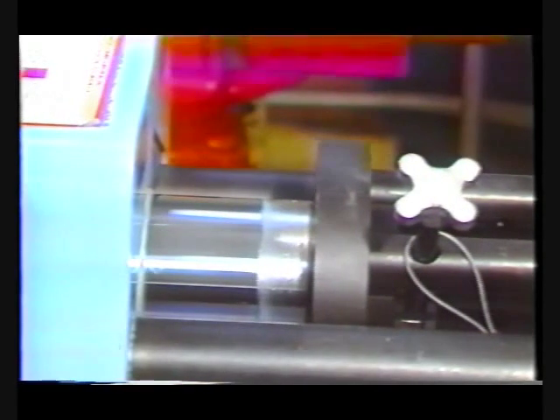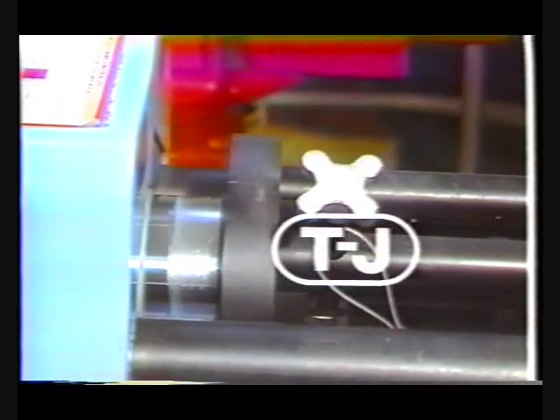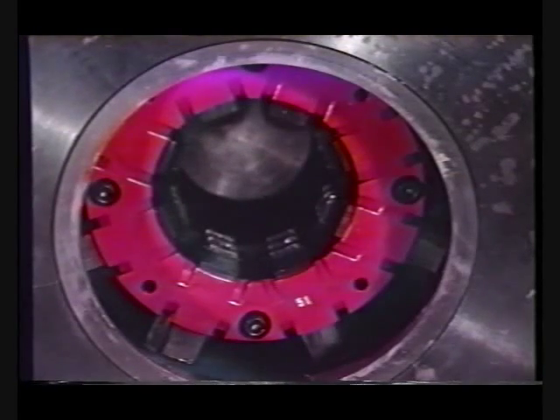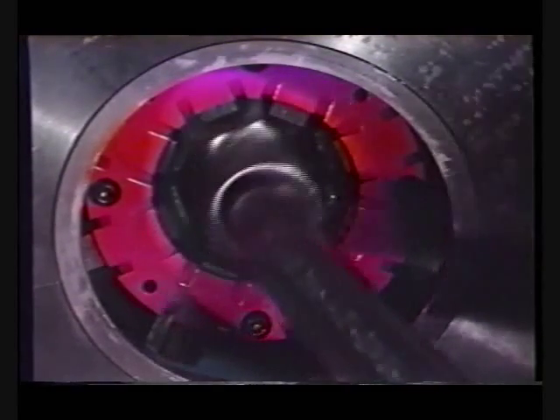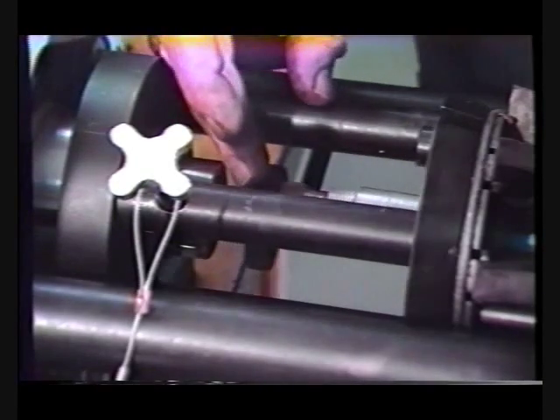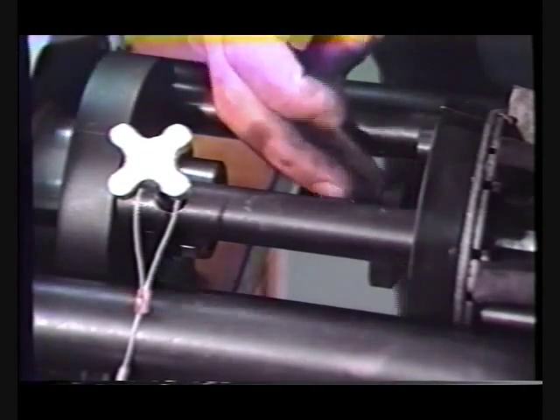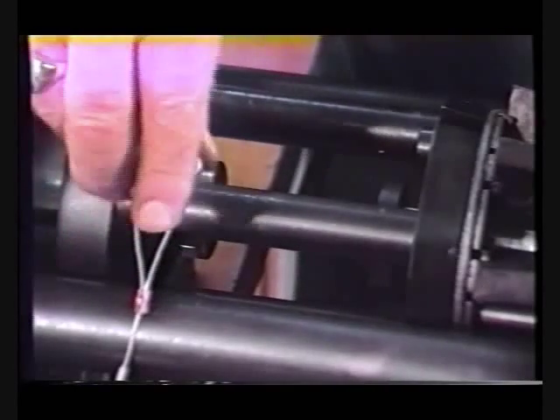The double-acting cylinder is designed and manufactured by Aeroquip's TJ division. The FT-1330 machine also contains a fitting backstop to duplicate fitting location for multiple assemblies. When assembling more than one of the same hose and fitting combination, turn the handle counterclockwise to loosen the collar. The backstop can be moved either forward or backward to the desired crimp position. Turning the handle clockwise locks the backstop at the desired position.